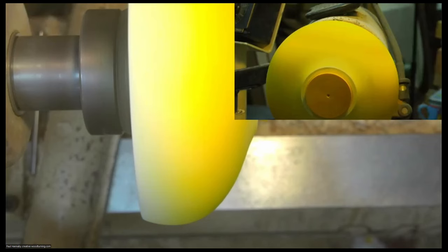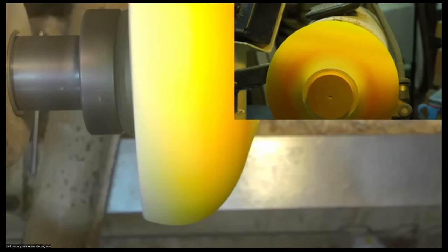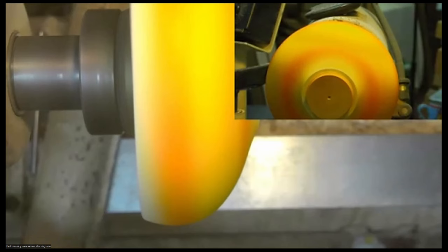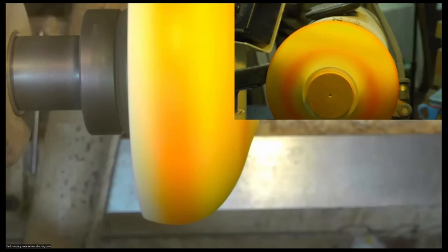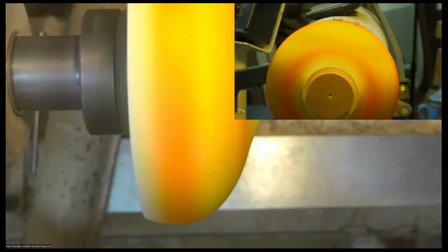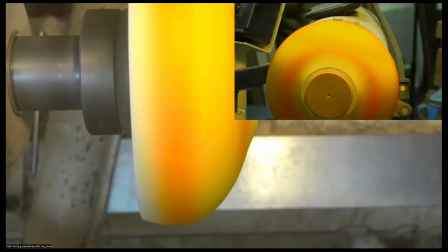Here I'd say three to five inches, putting the orange on the edge as bands. The lathe is at about 100 rpm — fairly slow. All I'm trying to do is bring the wood past the paint. If your lathe won't go below 500 rpm you'll have to work with what you've got, but as slow as possible is ideal. I've done my orange bands — the middle is predominantly yellow — and now I can go on to my purple. Because I'm going darker each time I don't need to worry too much about cleaning the gun out as I'm blending these colors anyway.